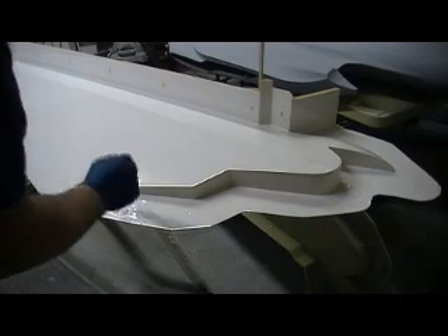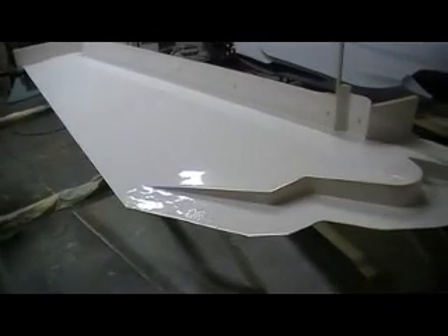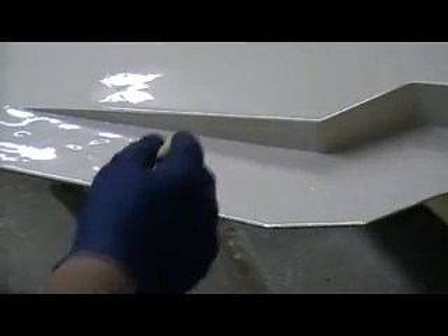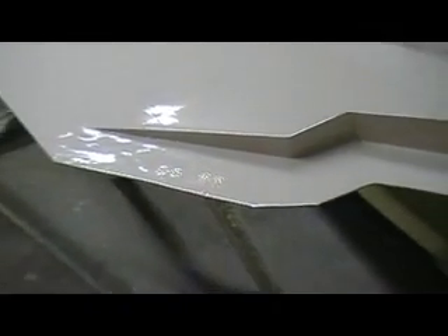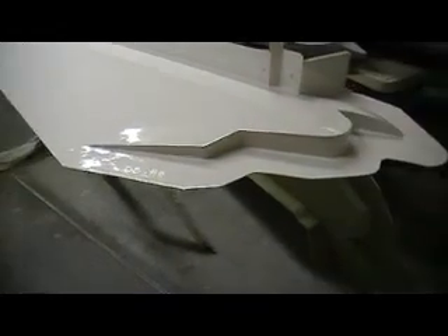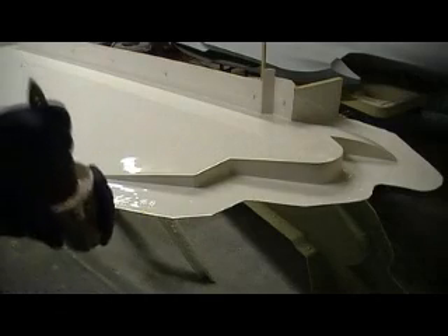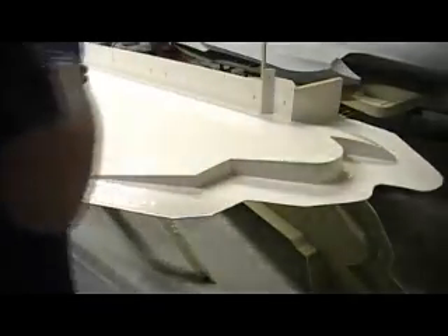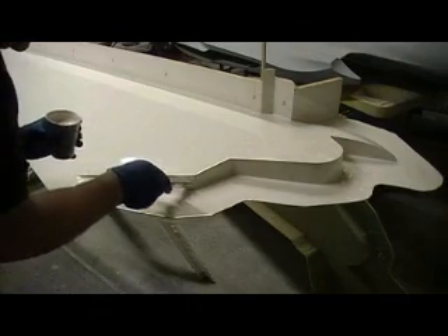The whole thing is not quite ready for another coat. It's just really starting to firm up good. You can see where I just touched that brush on there — it's firming up, but the whole thing ain't ready for another coat. What I'm going to go ahead and do is I mixed up some calcium carbonate with this batch, and I'm just going to put it on this vertical surface, maybe around this corner, to get me some thickness on this mold right here.